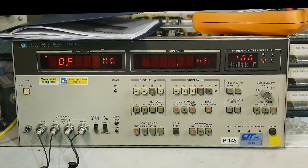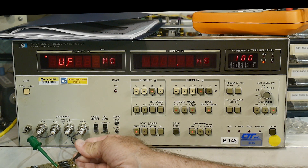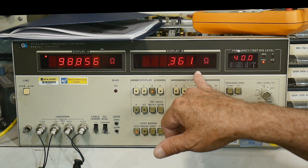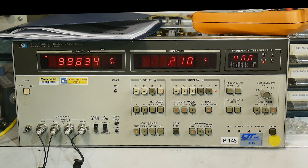There's something wrong with the resistance bridge on this thing. Going back to 100 ohms and switching to impedance mode - the phase angle is 0.2 degrees, which makes sense for wire wound resistors since they have a little inductance. Measuring inductance on them gives 1.4 microhenries - I'm not sure I believe that. Maybe I'm doing something wrong but I think the resistance bridge is way off.